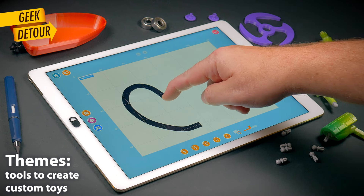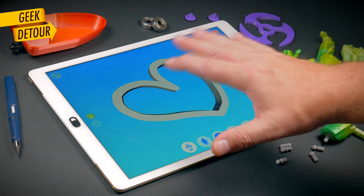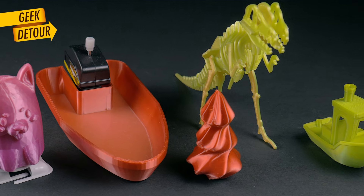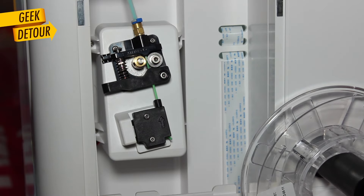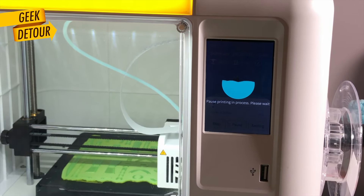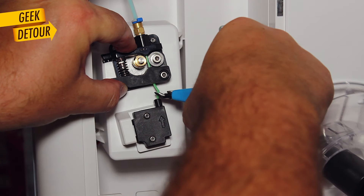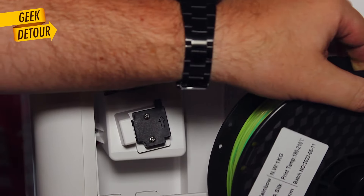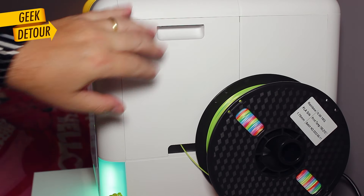We also tried some of the themes. Each theme is like a tool to create certain types of toys and customize them. Themes — hands down the best feature of the app. This is everything we could print just with the spool of filament that came with the printer. The spool finished when we were printing a warrior doll, and that was a cool test to see if the filament sensor works. The filament sensor worked, the job was paused. I had to cut the filament, pull the tip up and pull down what was inside the tube. I manually fed the new spool and told the printer to continue printing. Filament run-out sensor is so useful.